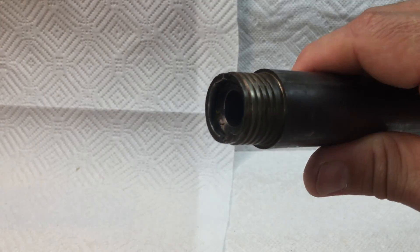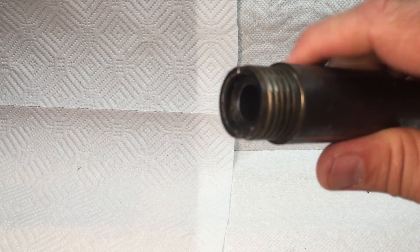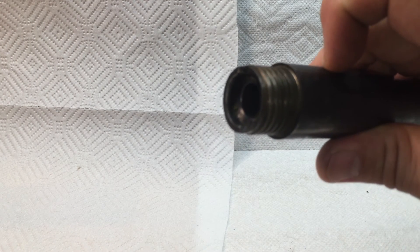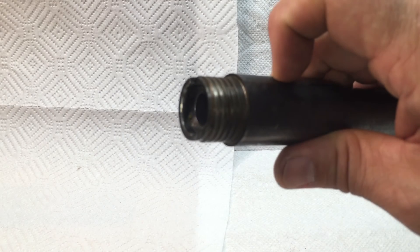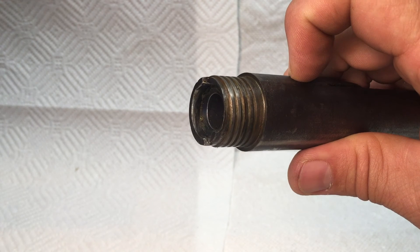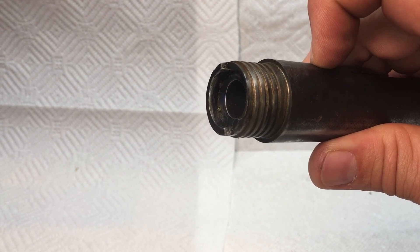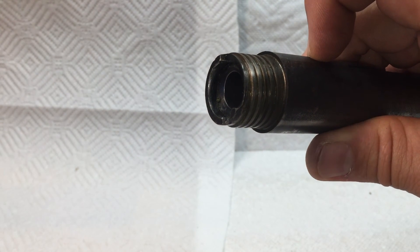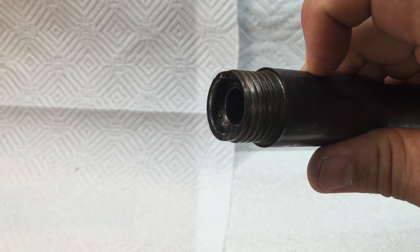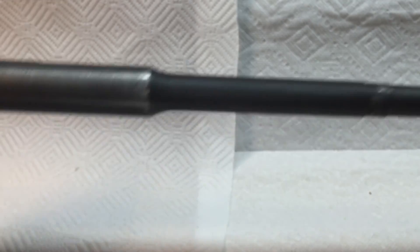This one is obviously dark — it's either been blued or refinished by some bubba. But it's not good for the functionality of your rifle; it's not going to help whatsoever. Even if you do all the things with the op rod correctly and everything mics up to the proper dimensions, it doesn't mean you're going to have good operation. This is probably one of the leading causes of malfunctions with your rifle.